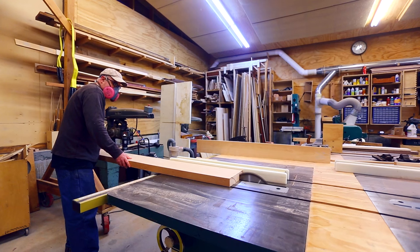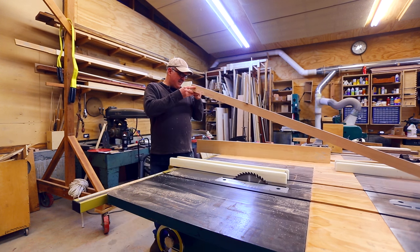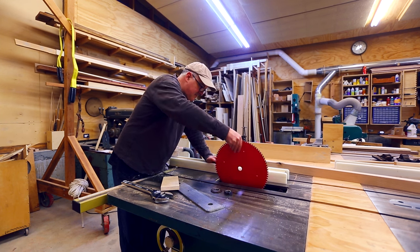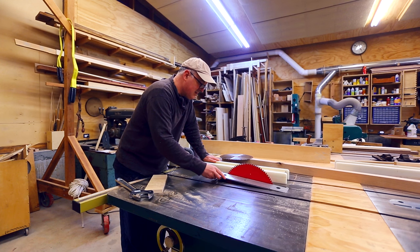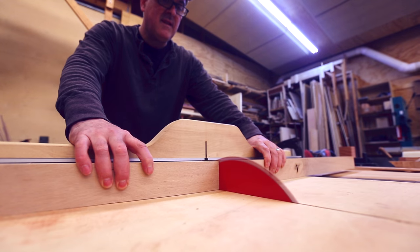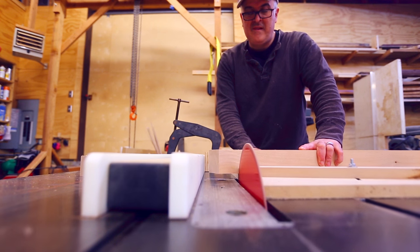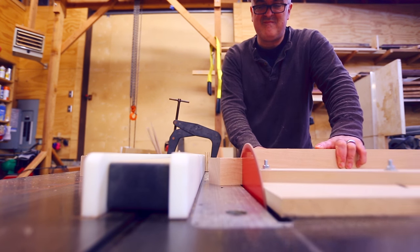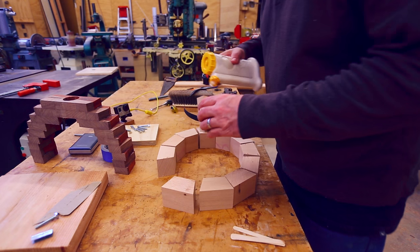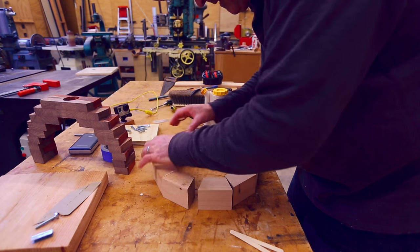So I had a better idea at this point, and I started the final ring out of the material I was going to use, which was beech. I got that ready and cut it into a strip, and got it ready to make segments. I was using the first version of my wedgie sled at this point, so I still didn't have that finalized, but it was working well enough to make the segments. I glued the segments together into a simple 12-segmented ring.